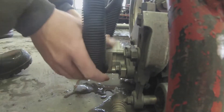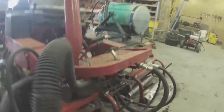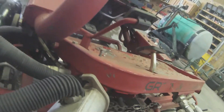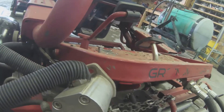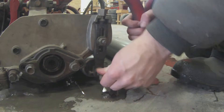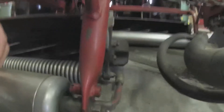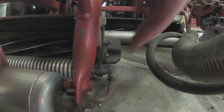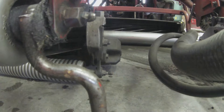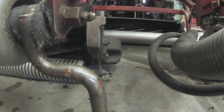There's a special spot on the front of the greens mower where there's a hole that's specially made to fit the motor in, so that it doesn't have to be sitting on the concrete where someone can step on it and possibly break the motor. Now I will unattach the front roller that's connected to the reel, unattaching the two spring-loaded clips on each side of the reel that connect to the roller. Then I will lift up on the roller so it's standing on the two spring-loaded clips, ready for us to pull the reel out.